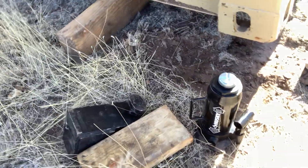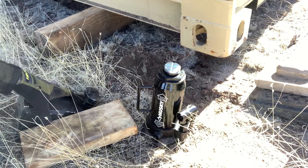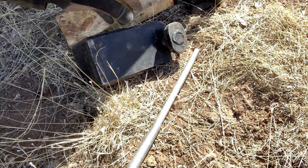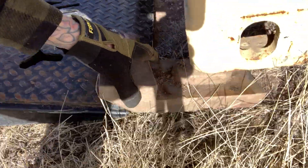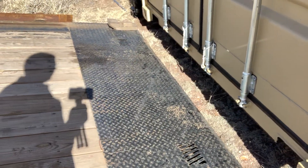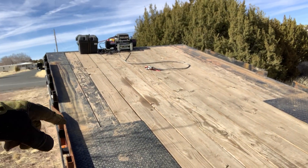Anyway, I just wanted to go over that. I'll put a link to this part in the description — bottle jacks from Husky at Home Depot or Harbor Freight, a couple of four-by-sixes, and this Superior Shipping container leveling apparatus. It's nothing super fancy; you could build this yourself, but at $125 with free shipping I couldn't build it cheaper with metal right now. I'm going to line this up on the skids when I put it on the trailer, shove underneath it, and it'll catch the bumper rails and push itself right up on top. Then I'll winch the last 15 to 20 inches with the chain winch.